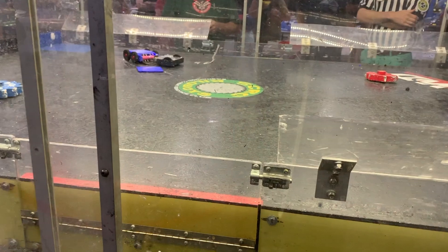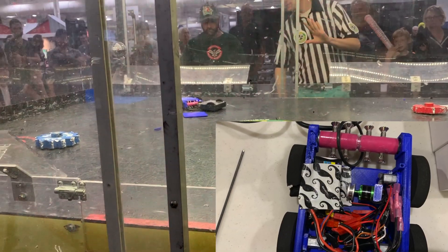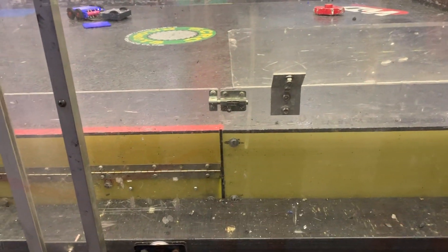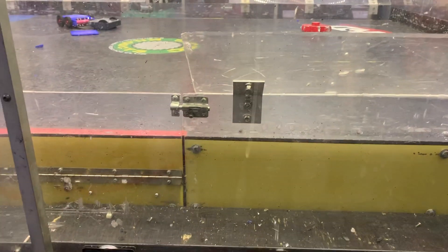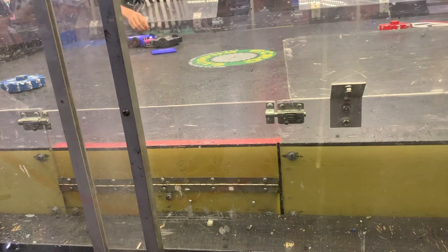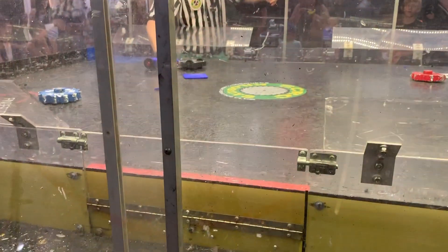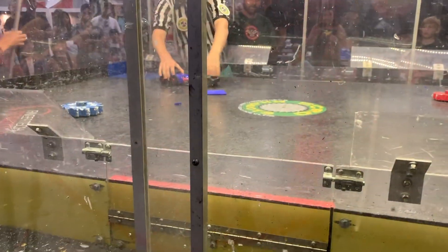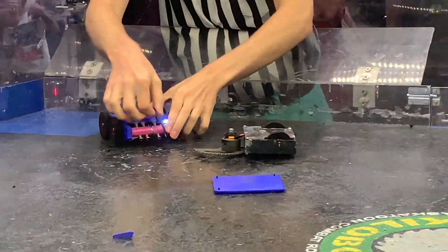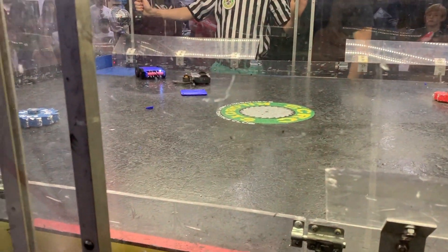This fight was quite short and disappointing. On the second hit, they took out one of my screw posts on the lid, and since the other screws were quite loose, the entire lid just fell off. I had to run Blastwave upside down due to the threading on the motor causing the pulley to simply spin off when the weapon got up to speed. In the same hit that caused the lid to come off, the weapon belt came off and became entangled in Lobotomy's weapon. This would normally result in an untangling of the two robots, but the battery was now hanging on the bottom of the robot, and on the next hit it would have caught fire. This is an automatic forfeit for good reason — lipo fires are nasty and toxic, and if you can prevent them, you really should.